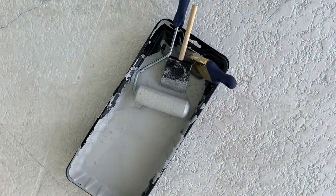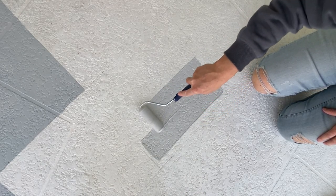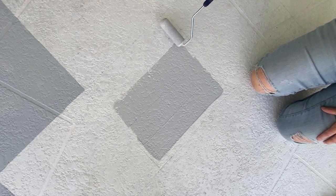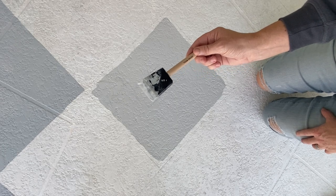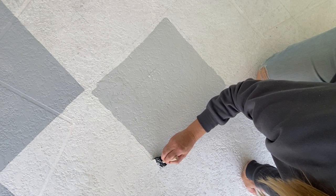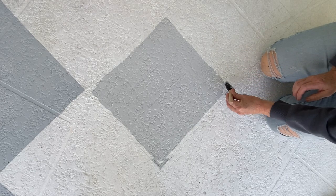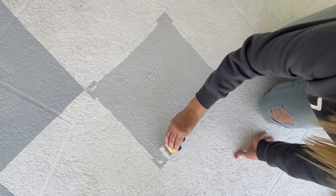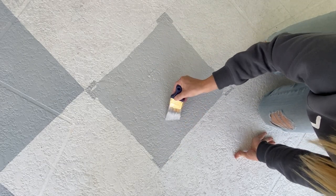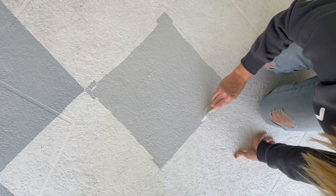We have a cold front here in southern Florida, so I'm going to take full advantage and paint as much as I can today. Because I'm not using tape, I have three different kinds of brushes. Here's the method I've worked out: first I'm rolling on in the center using pretty thick coats so that I won't have to do two. Next I have a sponge brush and I'm going to go in the corners — I learned this trick from Dima on Pretty on Fridays. And lastly I go in with an angled brush and do the edges. If you don't feel comfortable using the angled brush, you can use the sponge brush all the way down.